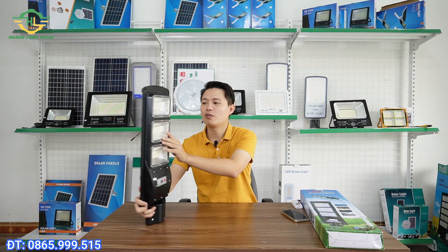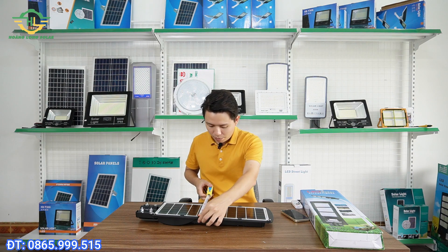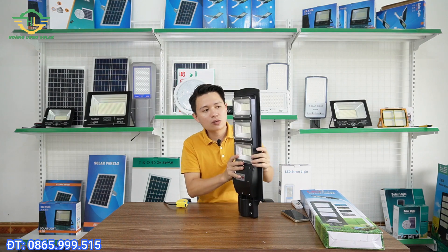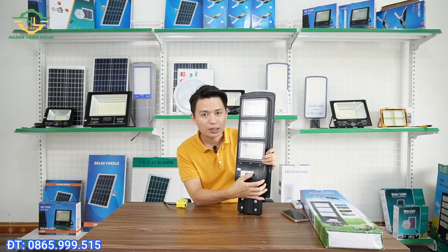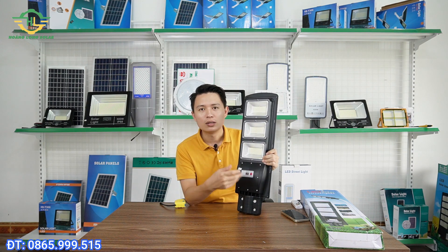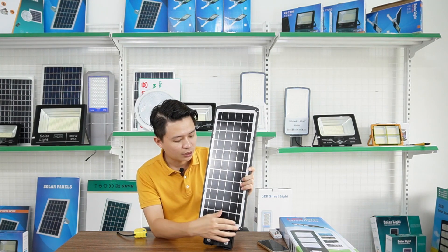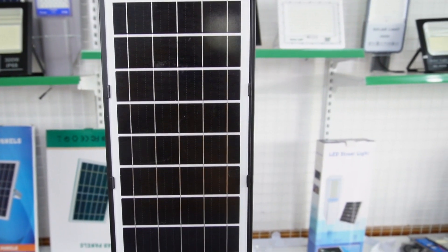Regarding the structure and functions, the total length of this lamp is about 60cm and the width is about 20cm. The front has 3 LED compartments, and inside uses 3 batteries sized 32650. There is also a manual on/off button on top. Next to that, most importantly, there is a motion sensor - that's the mode that detects movement to switch brightness up or down. On the back there is a solar panel. With those 3 batteries and the size of this solar panel, it can fully charge the 3 batteries, and with that operating mode I estimate it will run from 10 to 12 hours through a night.